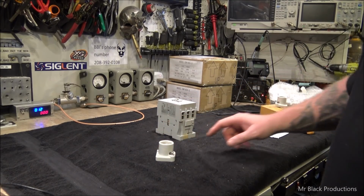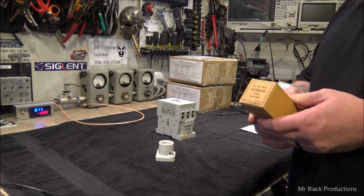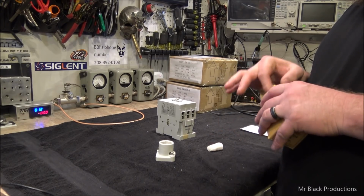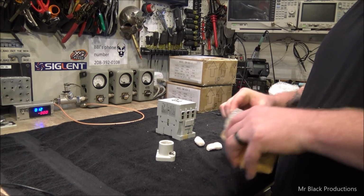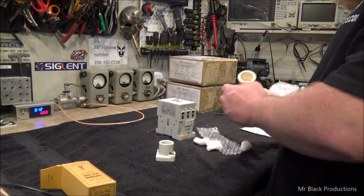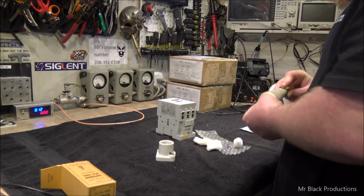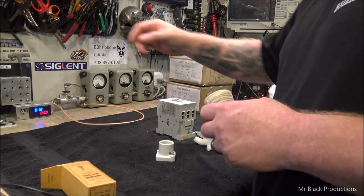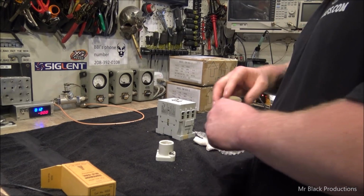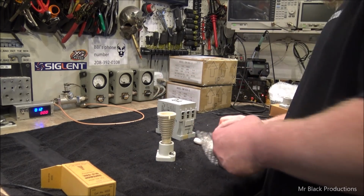And then sitting over here, this is called a superior Glo Coil. These are getting very expensive. Back when I built Vader, just to give you an idea on cost, this is about a $10 part. Now for a new one, which is what you want, you don't want to ever have a used one of these, this was a $47 part before shipping, or $49 part before shipping, this coil. This is a big wire wound resistor is all this is.